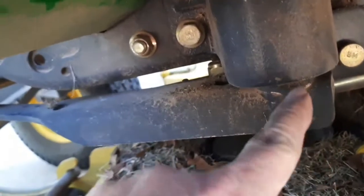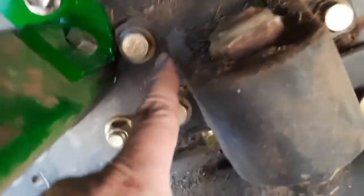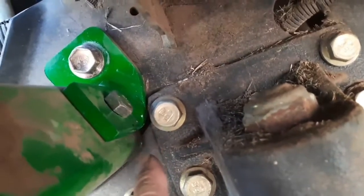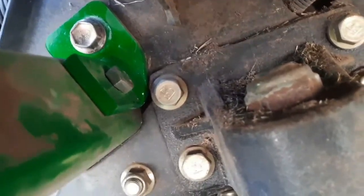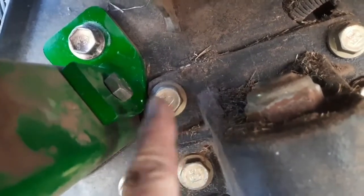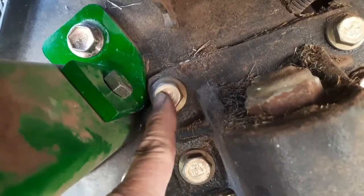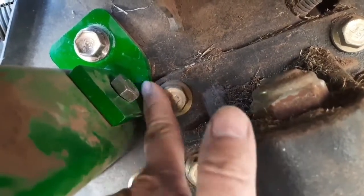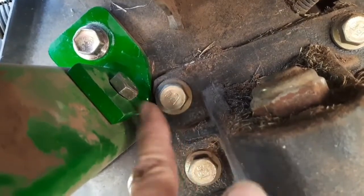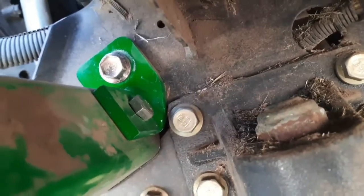Your steering pivot takes up the bottom hole, so what I did was just cut it off, painted it, put it back on. I don't really lift that much heavy stuff, but if I do, I'll probably just trace this and put it on top, pull this bolt, put it on top, and weld it all together — basically a stepped bracket here to help share the load.